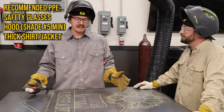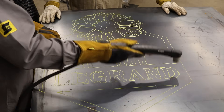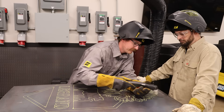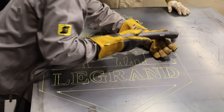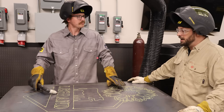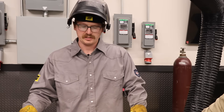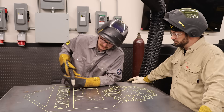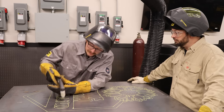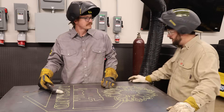We're going to get our PPE on. I like to do some dry runs to see where my areas are going to be tight in terms of reach. The first far one is okay — I can still flex, and if I have to I'll come to the other side. Are you going to be pushing or pulling the torch? I like to do both — just like the ABCs of welding, there are ABCs of plasma cutting. A lot of people get that elbow down and suddenly only have wrist motion. I like to put light pressure on my elbow and slide through. Let me kick on this fume extractor — we don't want to be breathing in those nasty plasmas.